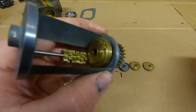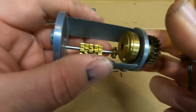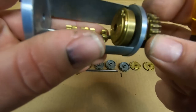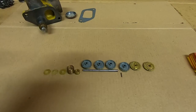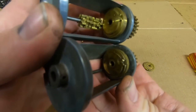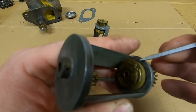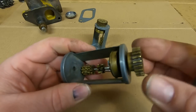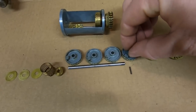One other area to really scrutinize for wear is these two little gear teeth right here, and the cavity below them. That's the area that's coming around and ticking that little pinion all the time when running, so that's going to be your heaviest contact area and your most chance for wear. Here's a worst case scenario for comparison — you can see both teeth on these little hubs are mashed over, the tip is just about worn off. Lots of wear; that's pretty much shot.